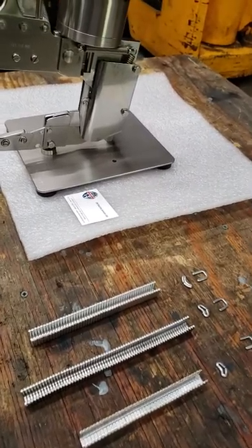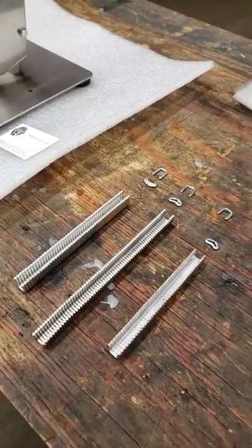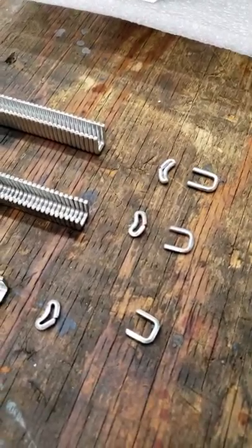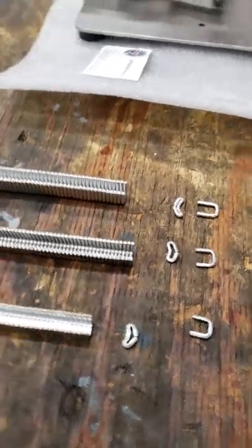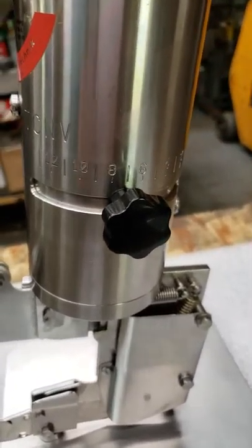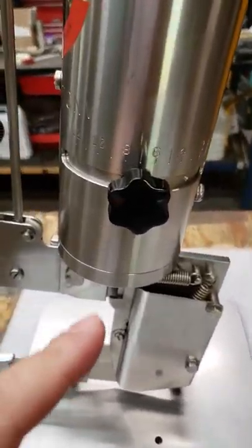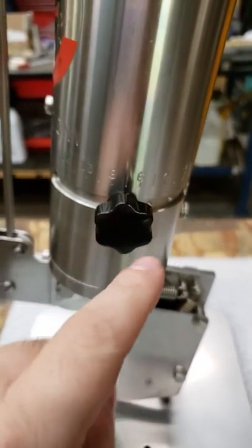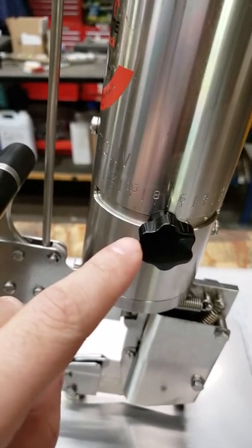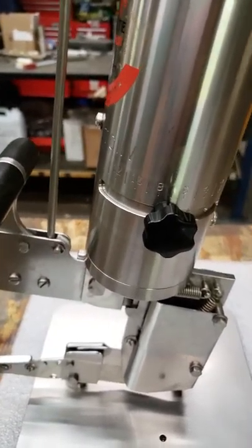This model can use several clips for bags and natural casing. Over here is a sample of the clips it can take — all the different sizes and how each clip will close. They're all slightly different, and they will all close depending on the pressure you put by moving this dial. The more you want to close the clip, you push it this way; if you want a wider, looser clip depending on the size of the casing or bag diameter, you put it the other way.